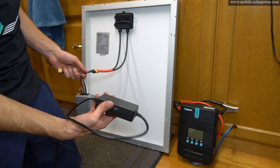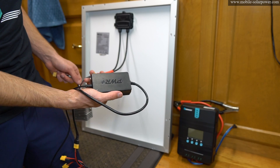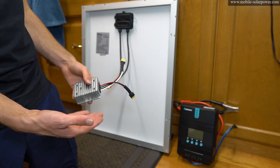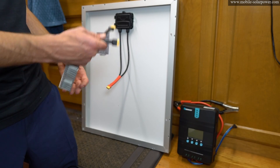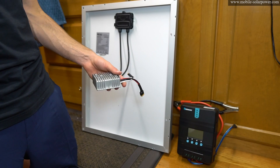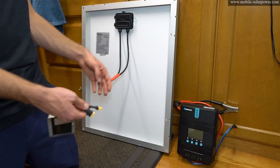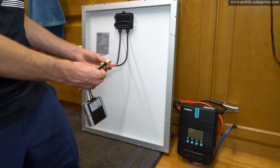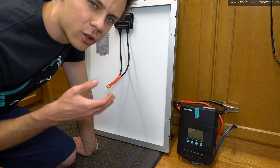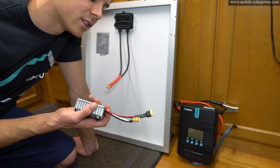It depends on what appliance you're powering — some will work great, especially ones with regulated power supplies. It's worth a shot; you won't hurt anything. But it is a good idea to check the voltage coming out of this after you connect it to your solar panel array, because if the voltage is really high and you series connect and then connect it to this, some of these work in a weird way where it will boost the voltage if the input voltage is high. I'm going to put a new page on my website with listed converters for different sizes and recommended solar panel sizes.